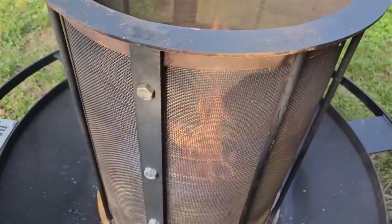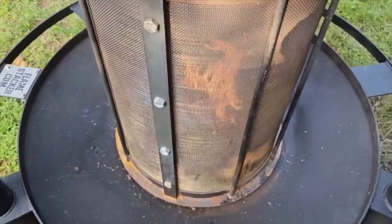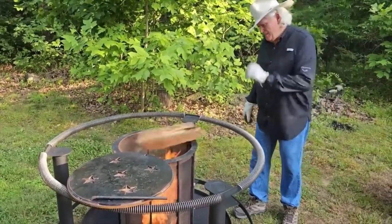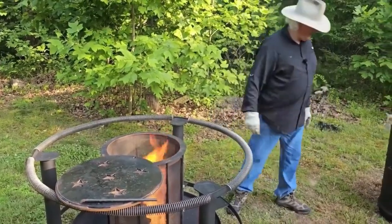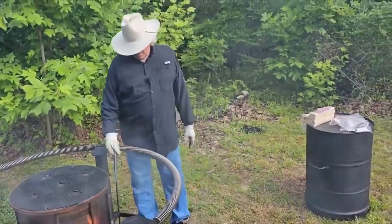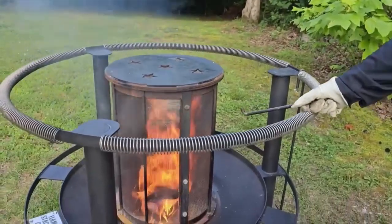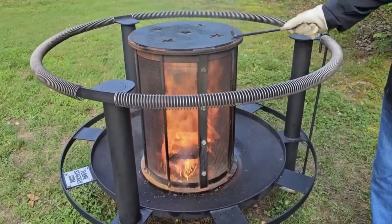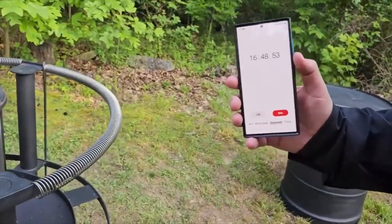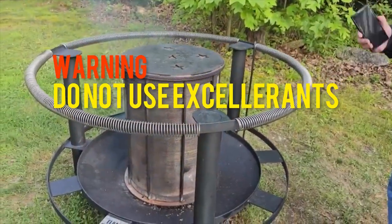Watch how long it takes to get a completely smokeless fire. In just a few minutes we're going to have a smokeless fire. This is exactly how carefully you're supposed to put the firewood in — the more random the better. This is the draft lid. The way this is designed, it gets plenty of air all the time. As you can see it's smoking right now, but in just a very few minutes this damper is going to concentrate the heat so much that even this smoke is going to go away completely. It's still smoking but it's supposed to — it takes a few minutes.